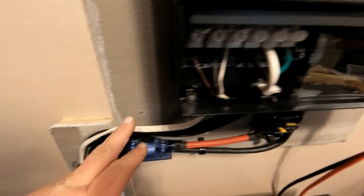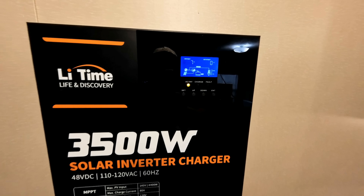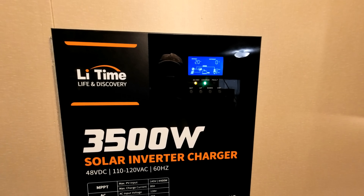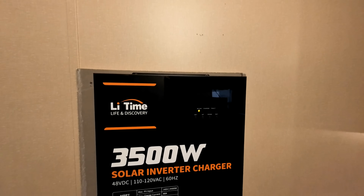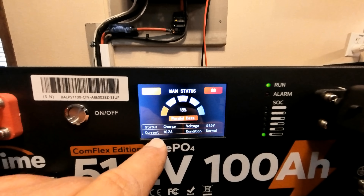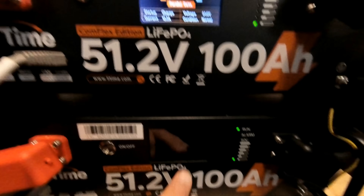What we have done is run the wire here where we could plug it into a generator or just plug it into the wall. This will backcharge the batteries when the solar panels just absolutely cannot produce any power. If you're in an off-grid situation, you'll plug it into a generator, but here we're going to plug it into the wall. Now that we're plugged into the wall, it shouldn't take but a minute or two and it should ramp up some power. And there it is — it's starting to push 20 amps into the batteries right now. So the solar and the wall are both charging the batteries. It shows 10.2 amps coming into each battery, which is basically a total of 20 amps between the two batteries.